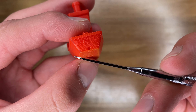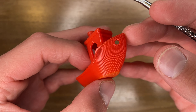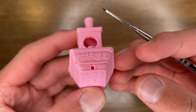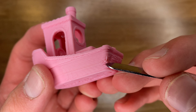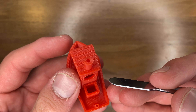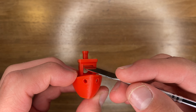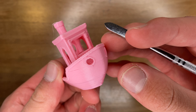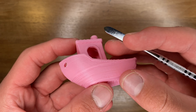The text on the back of the boat is essentially a test for how perfect your layers are on your print. If you can read the tiny text, then you have excellent quality — anything less than that needs improvement. The front window tests the bridging capabilities of your printer. If the top of the window sags, you may need a cooling fan, and if it still sags with a cooling fan, you may need to print a bit slower.